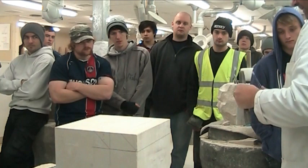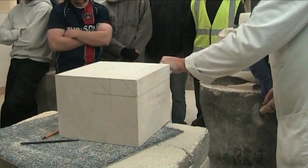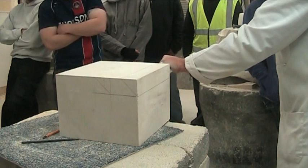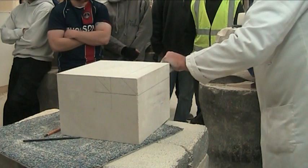With the chamfer, the first pitch I would do, I would line my pitcher up, and if you have a look there, I've more or less got the pitcher just hanging over the edge a tiny bit. That will stop it pitching off down over the face. I can just pitch it one way. What I would suggest is anyone move out the way a little bit in case a pitch hits them.